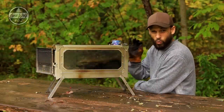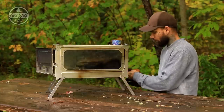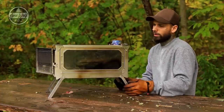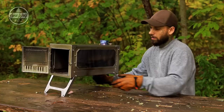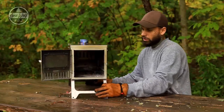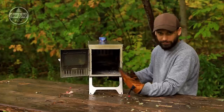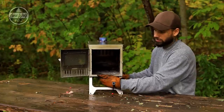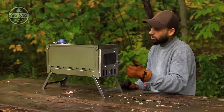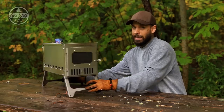The stove has burned for well over one hour and it's going through the cooling-down phase right now. I just dumped the fire out off camera into an outdoor fire pit. I'm going to put my leather gloves on and take the stove apart. The entire inside is blue and purple on the bottom and way in the back — so that did change color. I'm not seeing any deformation anywhere in the stove. The door operates totally fine, the draft functions perfectly, the damper — no problem there. Everything functions perfectly as it should.